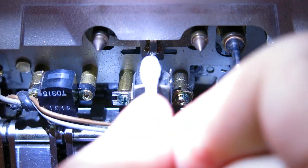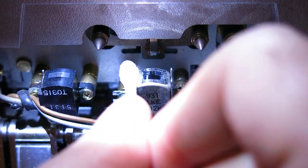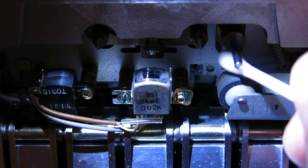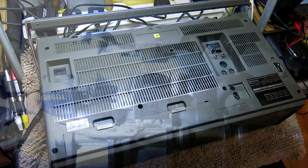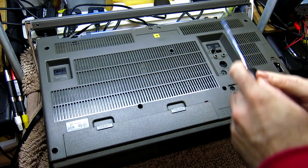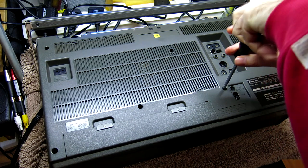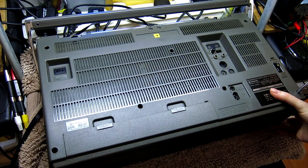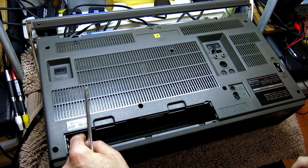Yeah, that's bits of polystyrene and some packaging — that's really weird. The heads are still a little bit murky on this one, so I'm just going to try some isopropanol. I can see a little muck on the capstan there. And the pinch roller wants the soapy water on it as well. Let's take all the screws out. Notice we've got one on the back of this — so it was opened by the owner. The sponge is going so we'll replace that. Battery springs look perfect.